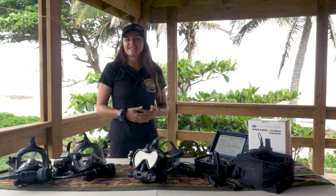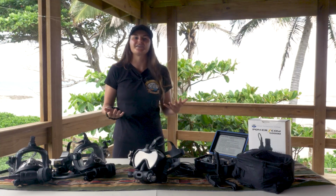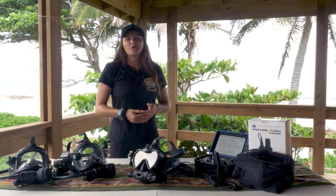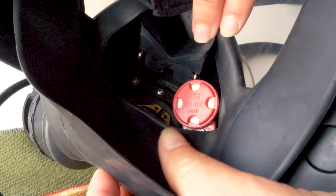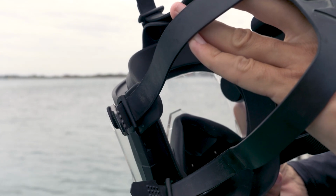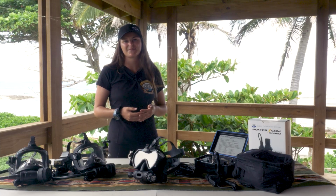Make sure your Dive Buddy systems are all on the same channel as you prepare your equipment. Next, let's go for a dive and repeat the processes you've just learnt. Perform your pre-dive checks. Make sure the microphone is in the proper position, exposed from the feather of the skirt to be at the corner of your mouth. Straps fully extended with the buddy phone pulled to the rear so as not to be pulled into the buckle when the straps are tightened.